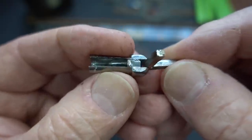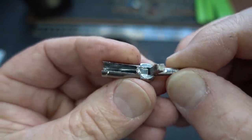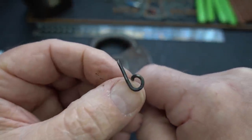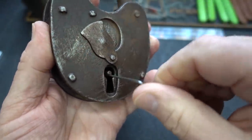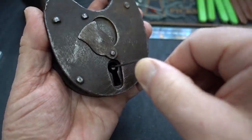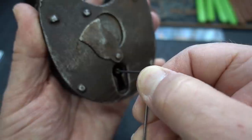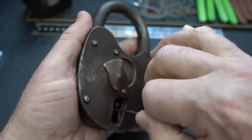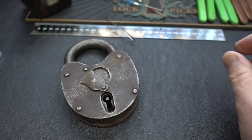I really did have high hopes for that. I had no idea the center section was some kind of steel and the outer part was cheap cast stuff, but got to make do. So I tried another little piece of magic — I found the thickest piece of piano wire that I had and formed a little loop in it. The loop, of course, is to go around that piece of piping. It slides in and works in there, and then I tried tensioning it like this. This is actually my third wire, so that ought to give you a clue — this isn't going to work either. Even when you apply really strong tension on the wire, the wire starts to bend and undo your loop. It just pinches on that piece of piping and doesn't allow you to put any tension on the lock. I twisted the first two of them until they broke. So this in theory is a good idea — just didn't work out.